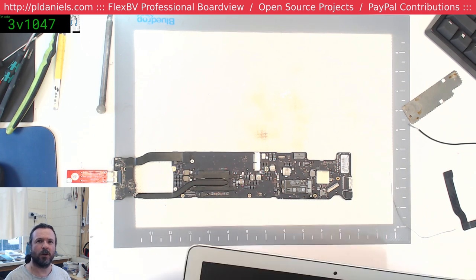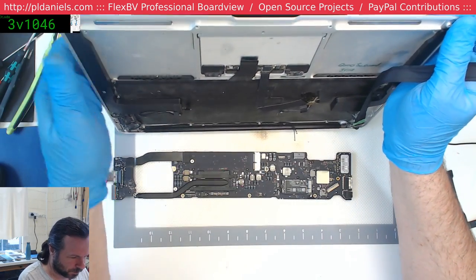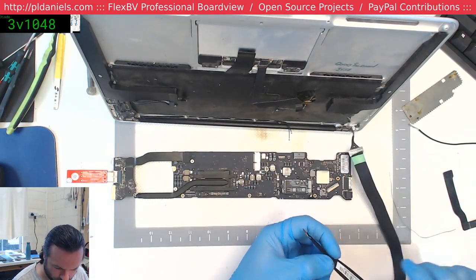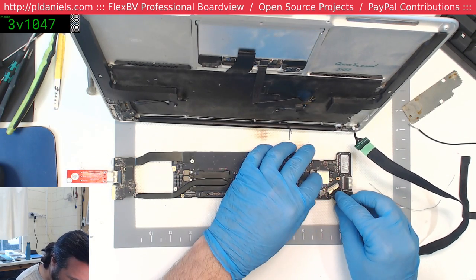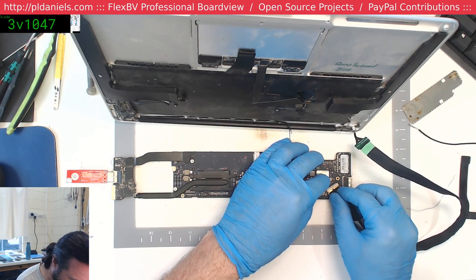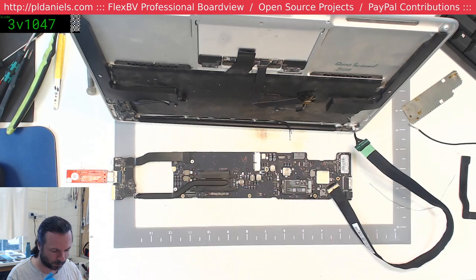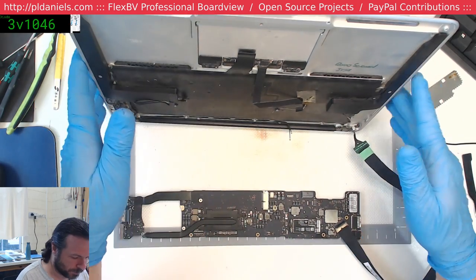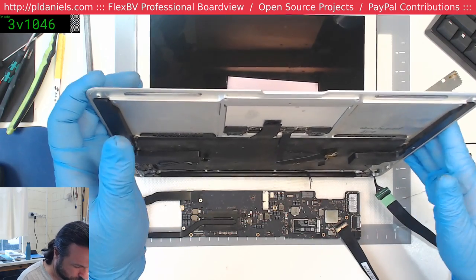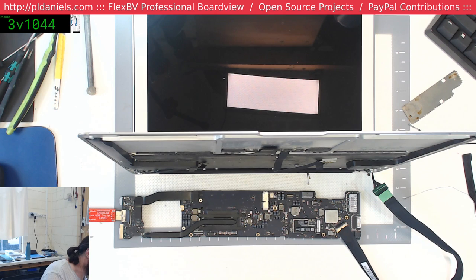What is an XW component? It's just a link. It's a wire. X basically means a non-specific designation. W would be wire. So it's what they use to connect two dissimilar named networks so they can still maintain the network names either side without having to put in something like a zero ohm resistor. So it's basically a zero ohm resistor, but it's part of the circuit board. It's about the simplest way I can describe it.